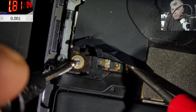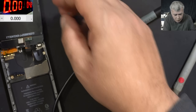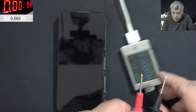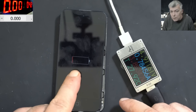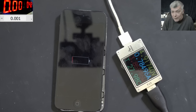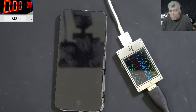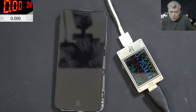At this point I want to do a test, because it is possible the iPod will start working. We have the meter here — plugging in the charger. 0.7 amps and we have the charging sign! Just to understand: it was looking like a dead iPod with jumping current. What was that jumping current? It was the charging circuit trying to bring the battery to a point where the iPod would charge.